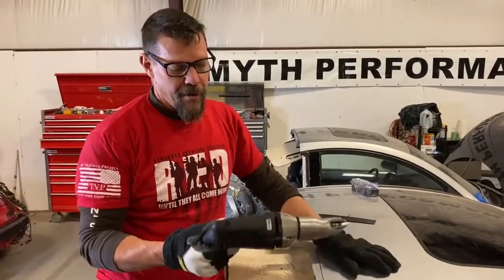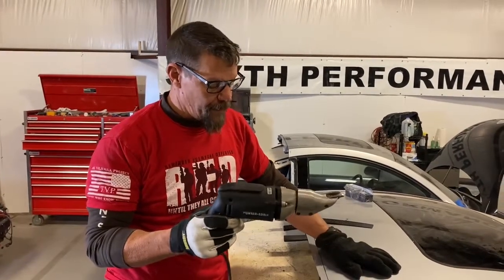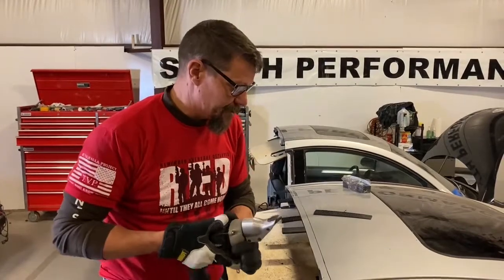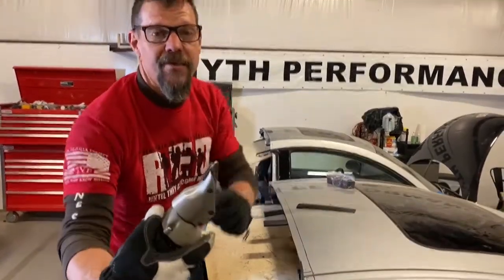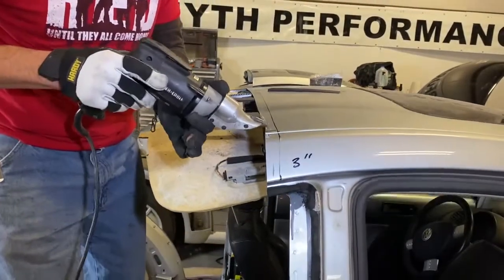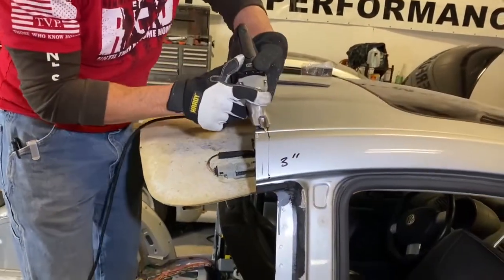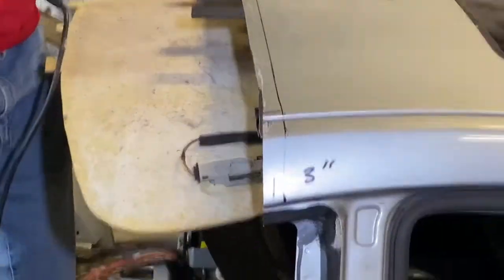These are the power shears. This is not an expensive tool — they're about 80 bucks. They work pretty well for this, but not necessary as Mark was just describing. I run a couple of those shims in just to give me room for the tip of the blade so I don't get hung up as I'm going across. I usually end up doing a little cut, then angling in and coming back and cleaning up that corner. All I want to take is that surface skin.